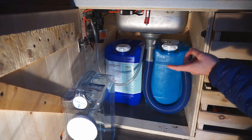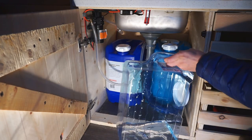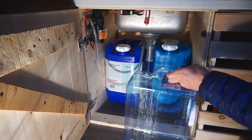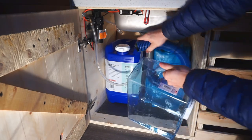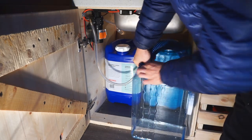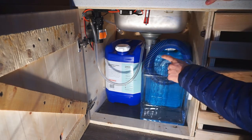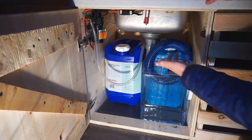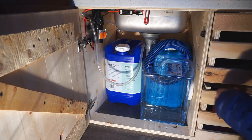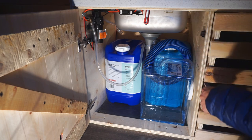And now we're going to test our whole system to hopefully see that there's no leaks. We're going to be using this container as our gray water container. We cut this little hole here so we just shove the other end of this into there. And now the loop that it makes basically acts as a P-trap. So let's turn on our pump. We'll run some water through the system and then we'll see if there's any leaks.